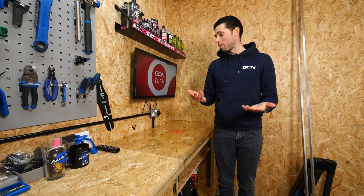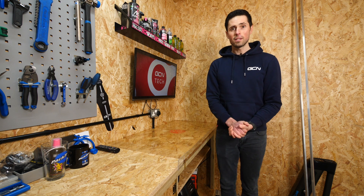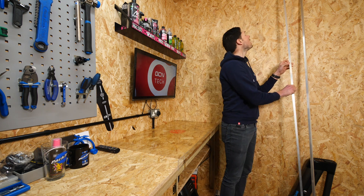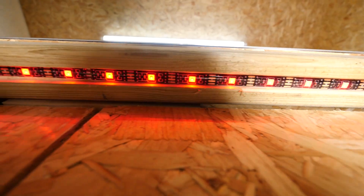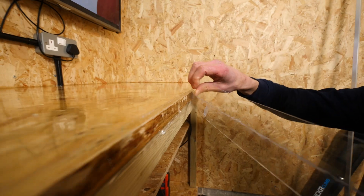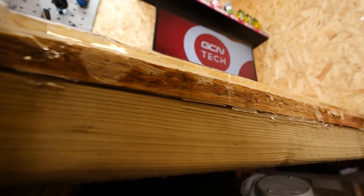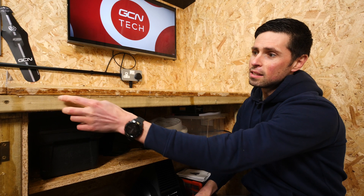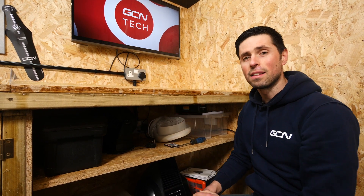We're back, and after a little bit longer than I had planned — it's taken the best part of five days for the resin to dry nicely. It does look nice and solid now. What we've got to do today is break off our edging and hopefully see what sort of finish we've got. Then we can use this edging here to put a nice finish all the way along our worktop. Spoiler alert — I've already fitted the lights underneath the worktop at the weekend; I was just far too excited and couldn't wait. The first bit's off and as you can see, even though I sealed up the edges as best I could with hot glue, the resin has found its way through all the tiny little gaps I must have missed. It looks like we're going to need to break off this excess overflow and maybe even sand down the edges before we put the beading on.